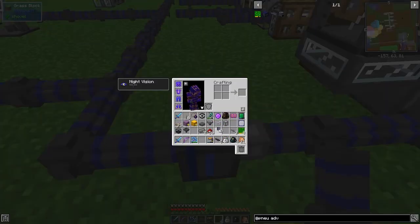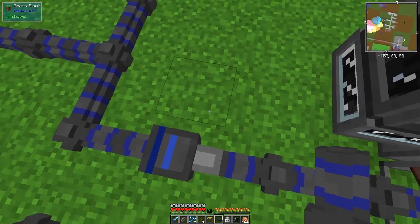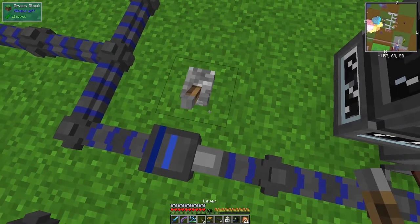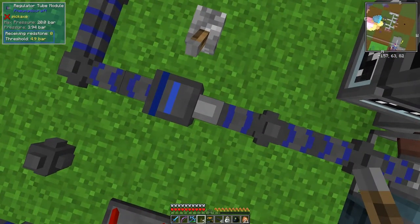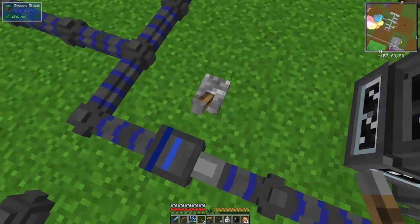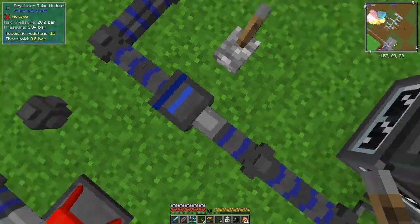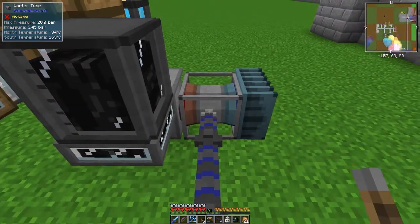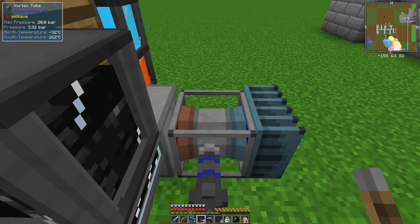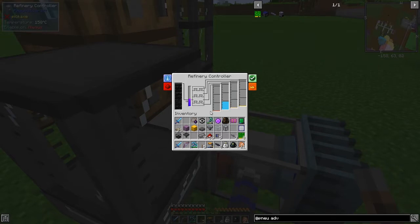This regulator will now have a threshold of 4.9 bar, so everything after here can't be more than 4.9 bar. You can use it with a lever as an on/off switch for this section of pipe. Put a lever down here like that — it says threshold of 4.9 bar, receiving return of zero. When we turn it on it says threshold of zero, which basically turns the airflow off into this section.